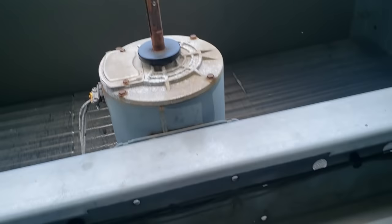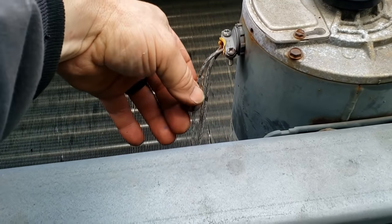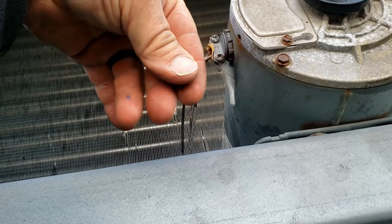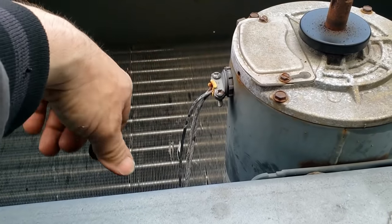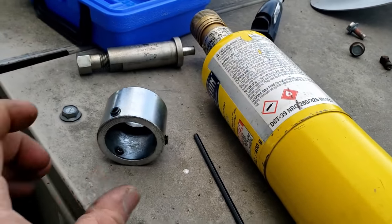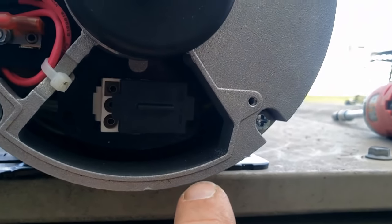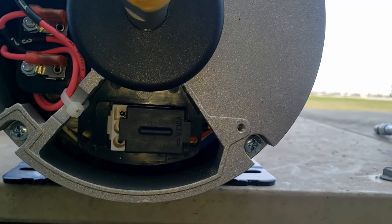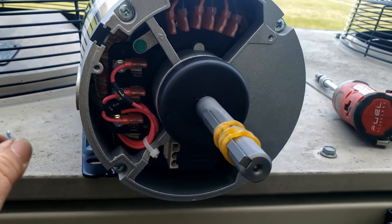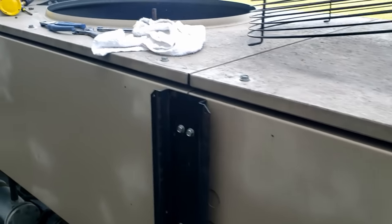On this one here, we're going to have to be careful — the wires look like they're a bit worn, but mainly it's just the outer jacket of the shiny part. Otherwise they look in pretty good shape — no cracks in the actual vinyl. So we'll get that done. It's hot enough — definitely hot. So it's 460 volt. I wanted to make sure that it was set correctly — these are the real easy plug, just yank it and switch it. But usually they come on high voltage, and I wanted to make certain that it was. Got the plug out of there, good to go. This has a really nice plate that makes it so easy to get in there.